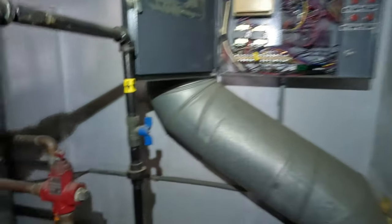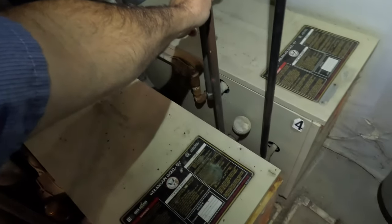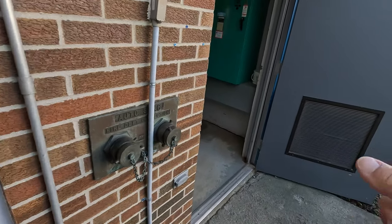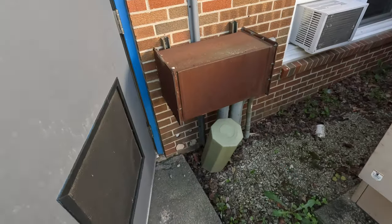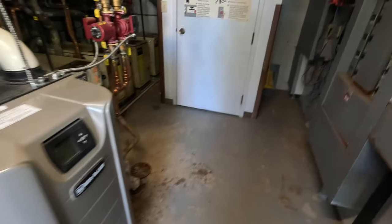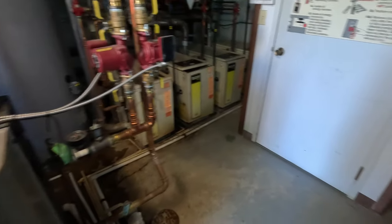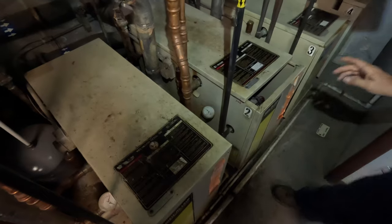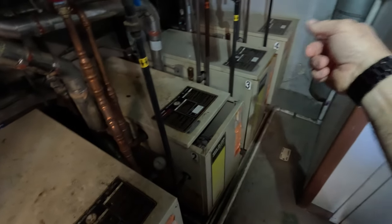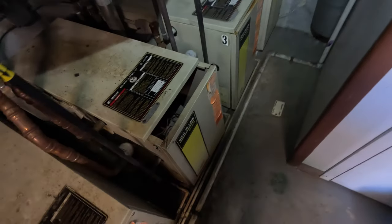Let's see if we're getting some warm water coming out. There was a timer that just stepped up - that one's putting out. That one doesn't sound good - they should probably replace this, that's what they were supposed to have done. That one's working. They've got an exhaust system here, this would be your fresh air. Yeah, they've got that monster door cut out there. Pretty much every appliance in here is partaking of that air - I think it's one square inch per so many BTU. It's just timing them one to the next - this one's got issues and I'd like to see it turned off.